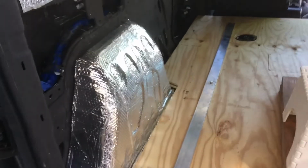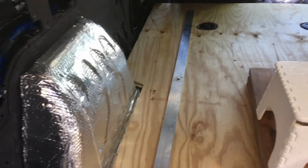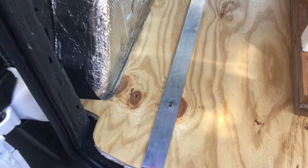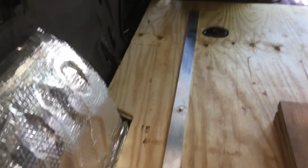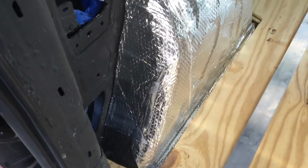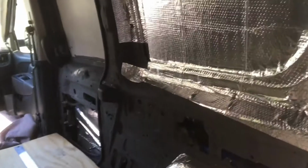Now one thing, it's really important to be careful about your template. I laid the template down inside of this van many times, and I marked all of the anchor bolt holes, because these are unforgiving. You don't drill another anchor bolt hole, so you need to be able to accurately identify where those anchor bolt holes are, so you can drill the holes in both your plywood and your foam board and your 2-inch aluminum bars, so that you can connect to those holes. And one thing I've done is I've left a little gap here. My idea is I'm going to be tucking 1/2-inch fiberboard into the gaps along the side of the van to insulate the walls. So that's what those are for.